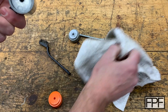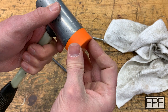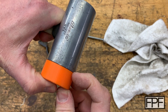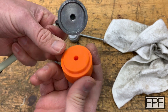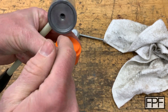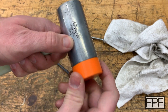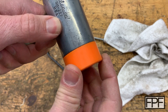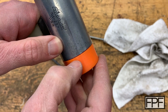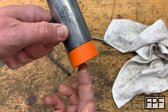That looks pretty good. Oh, that looks just about perfect. It looks like we might have the tiniest gap here, which is probably good because we really want the majority of the force to transfer from the front to this back face and on to the face of the hammer. There's like a couple-thou gap — probably about five thou. I can't get my fingernail in there.